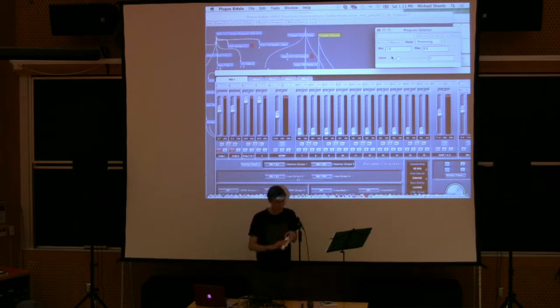So in terms of the actual development, this is the current CPU board. It has five 32-bit CPUs, which might actually seem like overkill, but somehow they all add up quickly. It has the one main PSoC 5 for doing most of the hole sensing, and the logic of checking the breath, deciding what holes are covered and sending out signals. Then, because it has so many extra buttons and sliders, I needed not one, but two additional touch sensor chips. And in addition, it has another chip for running the synthesizer algorithm, which is a 180 megahertz floating point CPU, to make algorithm development faster.